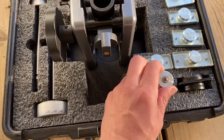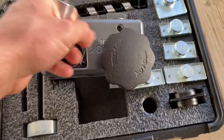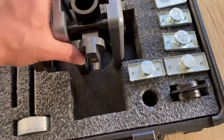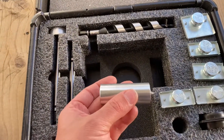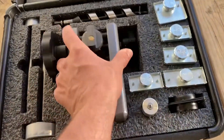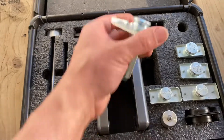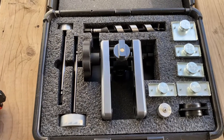Then you take this little piece here — if this is the door, looking at the side here, you shove this in the hole, or if the door is open it's easier, you just pop it in like this. Shut the door and this marks exactly where you want to drill for your bolt. Once you've drilled for where your bolt or latch is going, you can take your stamp again and stamp for where your strike plate is going to go, giving you a nice easy guide for everything you need to do.